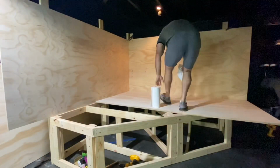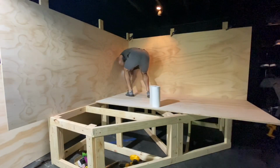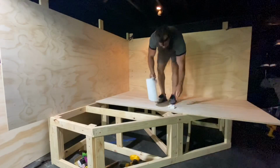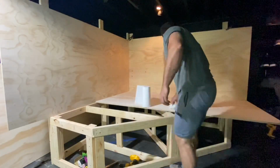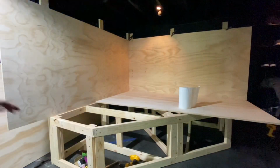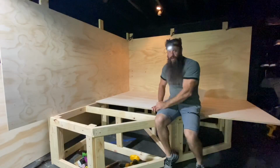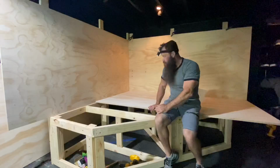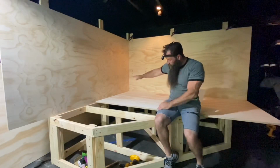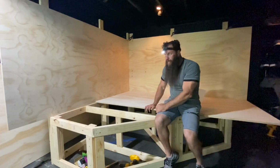Fiberglass strips later line up here, like I said. I'll probably double up on the screws down there. I set them at about 6 inches apart, maybe more like 8 to 10 in some places. But once I get everything in position, I'll move over from where the joist lies and make some more room for the drill to get in and tie in a few more, especially the corner ones.